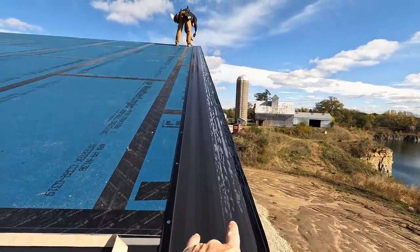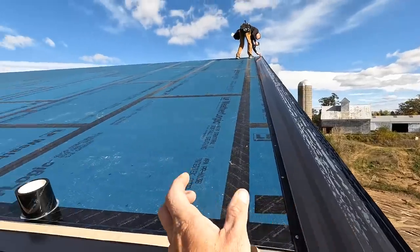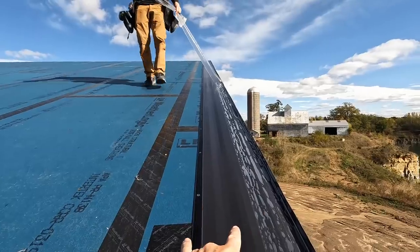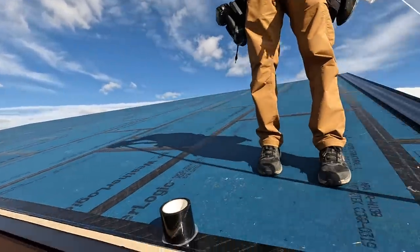In order to put that bend-up in, we had to cut a panel down. And in order to cut a panel down, we calculated the distance for the entire roof. The extra was whatever it was, 19 1/4. So we cut that in half and put a 9 5/8 piece on both sides.